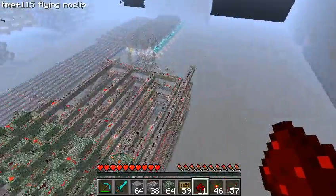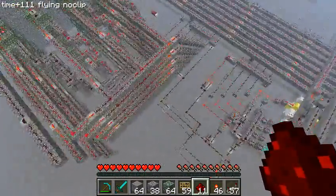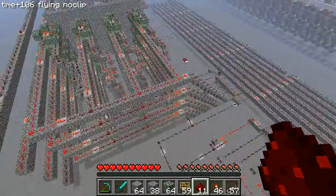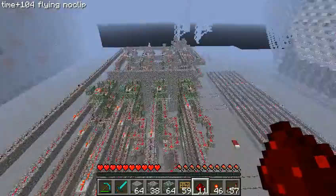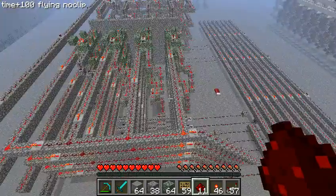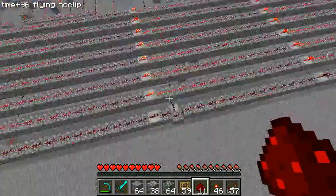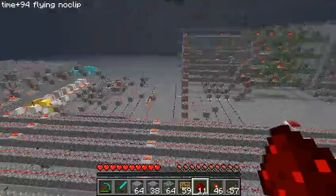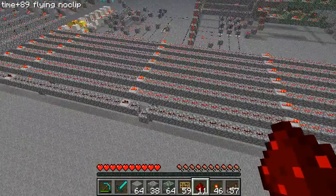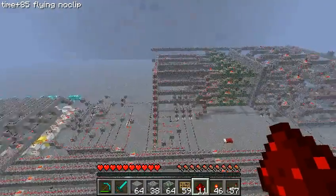What I've got to do now is connect this return bus to the write input — to write information to one of the registers — and add the addition opcode here to trigger it to write. Because at the moment only the load opcode is telling it to write. I've got to adjust it so that if it detects addition, then it should instruct it to write as well.